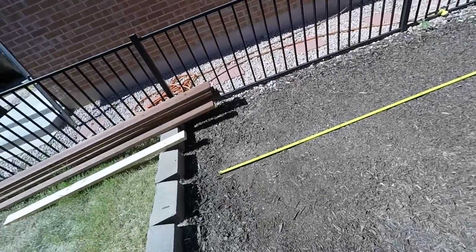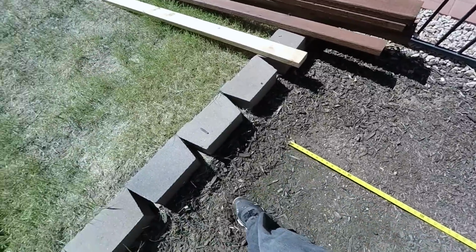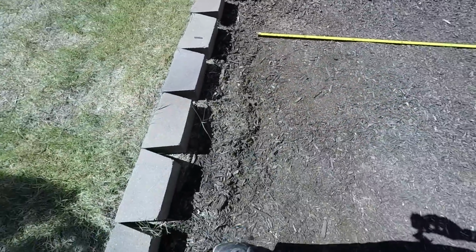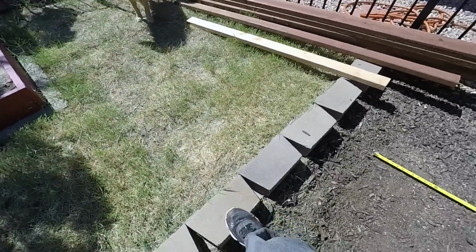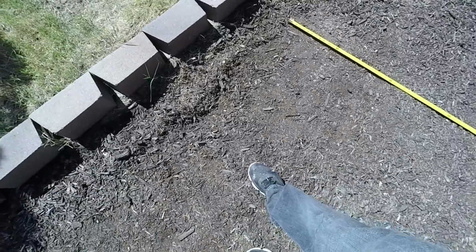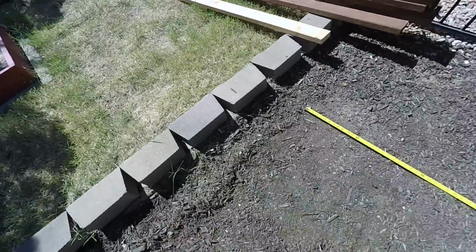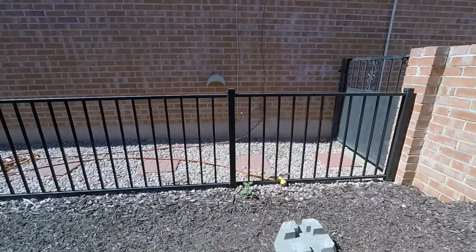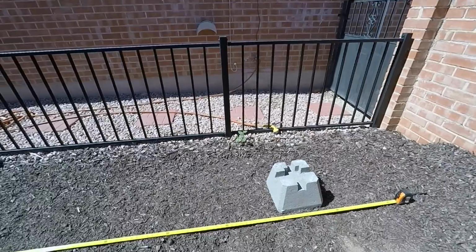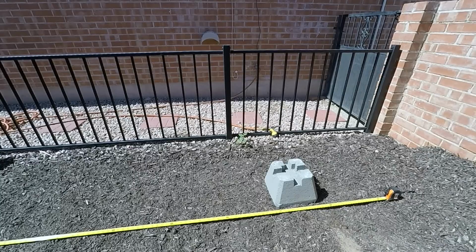Okay, so this step now is figuring out where you want to lay these blocks. Get a general idea for where you want the ending of your shed, or the front of your shed, to be, and an idea to where the backing of your shed is going to be. So you want to make sure you have some area around your shed that you're going to be able to walk around as well. So there's different ways to do this. You can make batter boards and put 4 corners on each side and level everything out with a string level, and do different ways. I'm running off of my wall here, and basically just getting a general idea of how far I want it off from the wall, and I'm dropping the block in one spot, making sure that everything's going to be even from that point on.